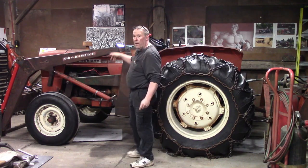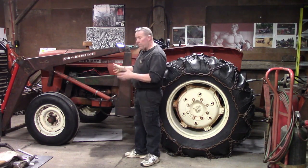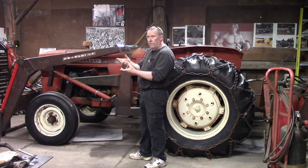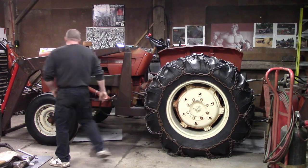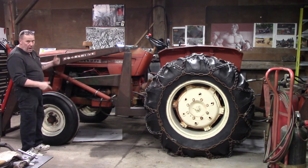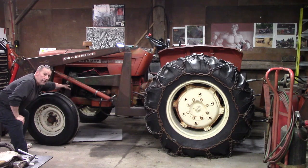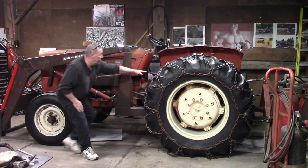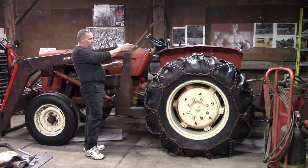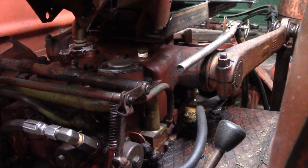— the pump that runs the loader, if you have one, and it'll run the three-point hitch and two remotes at the back. Power steering works fine — the power steering pump draws its fluid from the same pipe; there's a T or a Y in it, and it's driven off the crank at the front. The auxiliary hydraulic pump drives off the timing and is bolted right in at about that level. The reservoir is higher, however it has a bend that comes up and goes across — you can see that there.